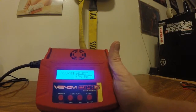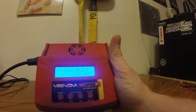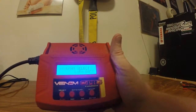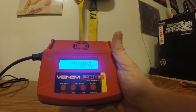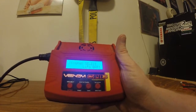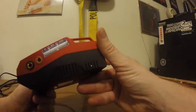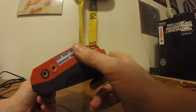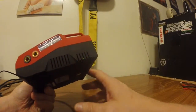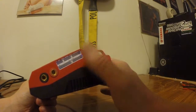Last but not least, we have the Venom PR2 charger — a nice jack of all trades charger that can be found just about everywhere. These are readily available in almost every hobby shop and cost about $75 to $80 depending on where you go. It does a nice complement of batteries: LiPo, NiCad, NiMH, LiFe — just about any battery you can throw at it. It will do 1 to 6S. It does have the balance port built in, though that's not one of my favorite features — because if anything gets messed up in there, or you need to change the tips out like you periodically do, you can't do it on this charger. Once that's done, it's done.